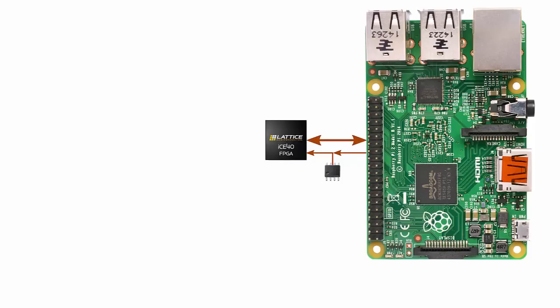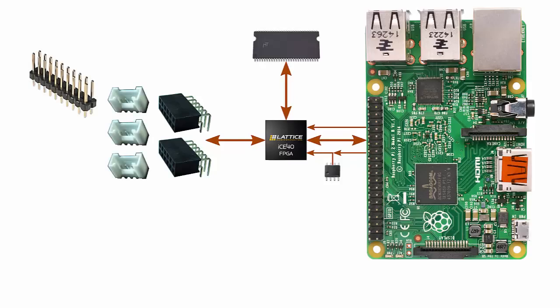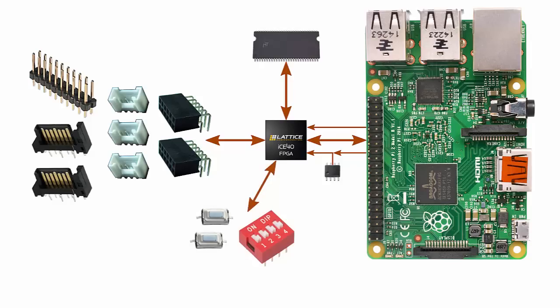Connect the remaining GPIO from the Raspberry Pi to the FPGA so they can talk to one another. Break out the GP clock zero line and use it as an adjustable frequency FPGA clock signal from the Pi. Tack on some SDRAM the FPGA can use for local storage. Add ports to the outside world: PMOD connectors for PMOD boards, Grove connectors for Grove boards, a generic pin header for whatever boards, and a SATA connector for boards that use differential I/O. Attach some user I/O like buttons, switches, and LED blinkies. Supply an additional 100 MHz clock oscillator for standalone operation.